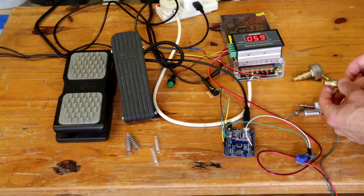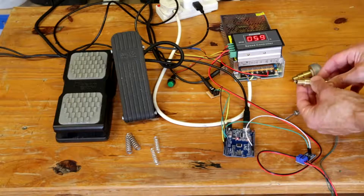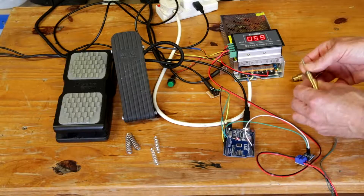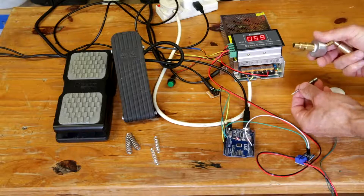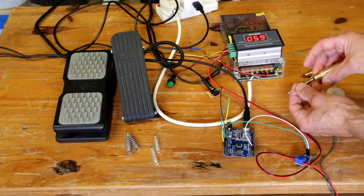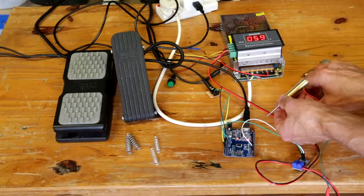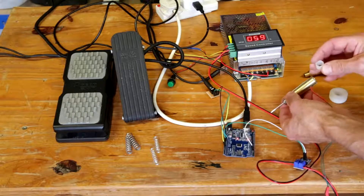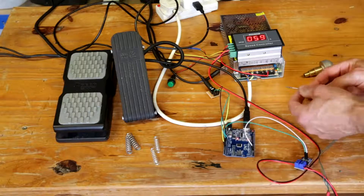The handpiece is made from essentially a piece of tube which I've bored out a little bit more, and I've put a piece on the end so that I can fit my normal engraving bits in. This is my normal pneumatic engraving tool which fits exactly the same tools. Into this I put the solenoid, then the piston and a little spacer, and then that goes together like that.